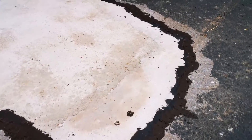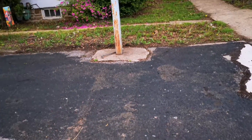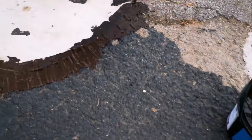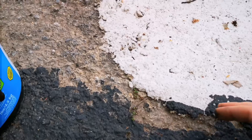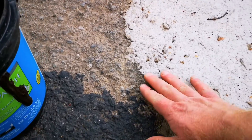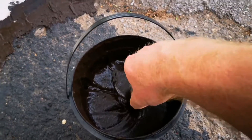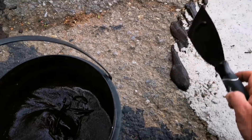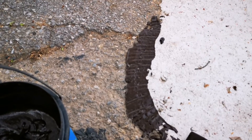It's the next day. We got a little bit of sealing done — it did get a little dirty but this stuff washes off pretty good, and it still looks better than before. Now we've got the BlackJack patch and we're sealing that edge of the concrete. If you don't, what happens is you get a little piece like this and boom, it breaks off. This is basically going to lock in that edge and keep it fresh and help it from cracking. To apply it: take a scoop, put a little bit right along your edge — you don't want to cake it up too much — then spread it out just enough to lock in that edge.